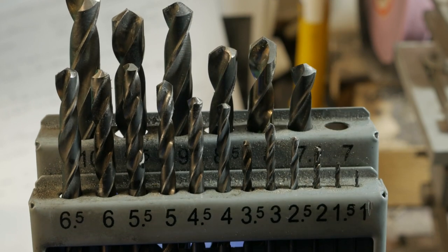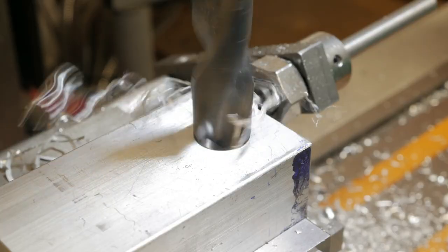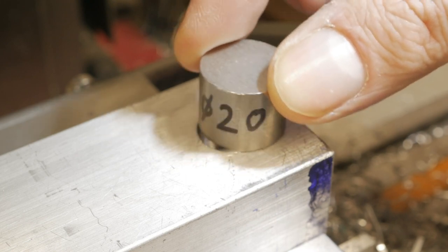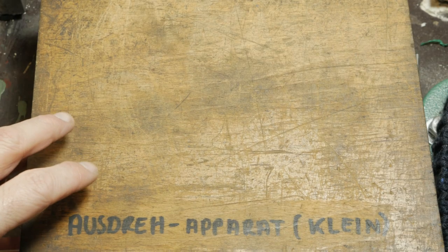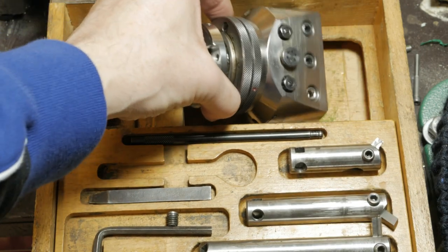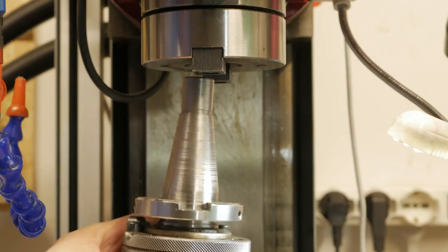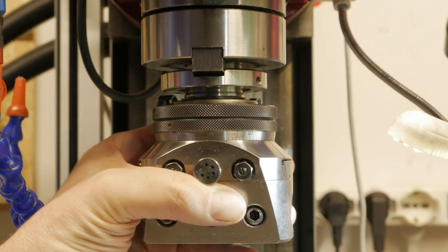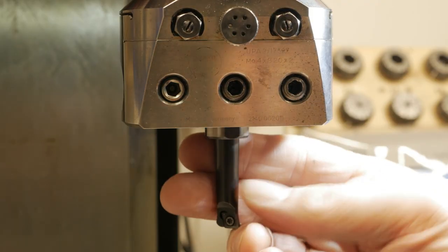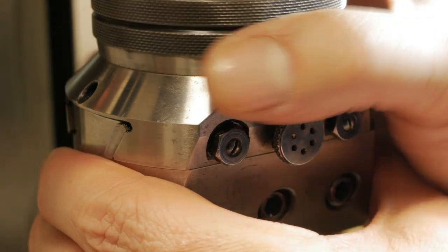I thought that the pin should rotate on bronze, on two bushings, not directly on the aluminium, and for this reason I use my boring head, always very precise, and obtain the seat of the bushing. It was not very easy to do the centering. For this reason, I made several attempts observing the rotation of the tool around the hole.